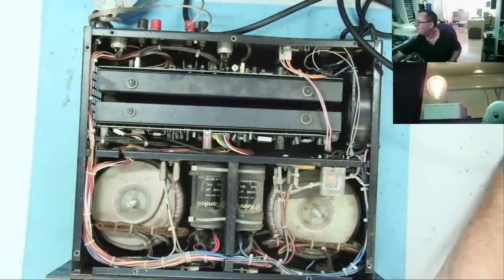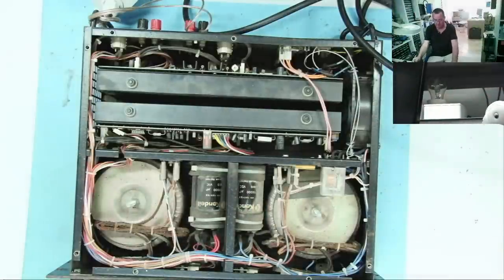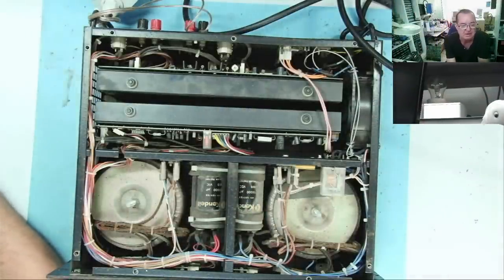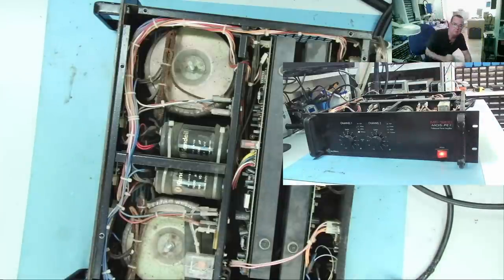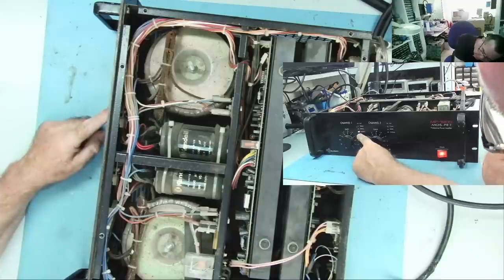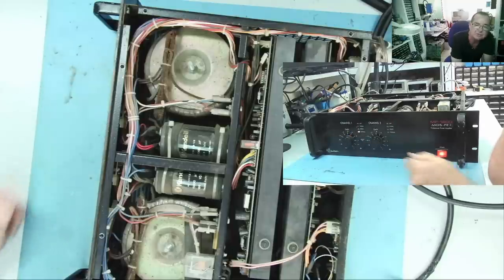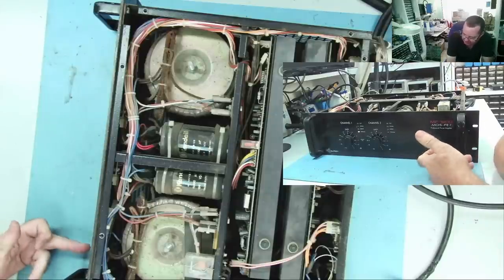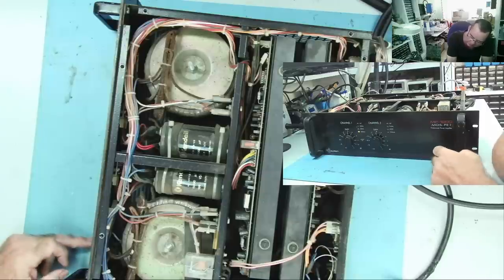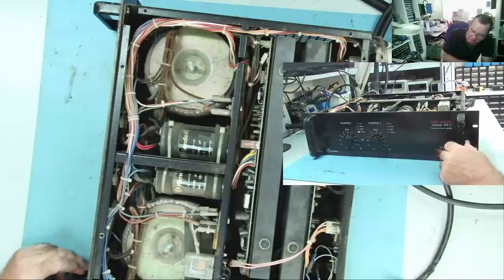It comes on bright and then is going dimmer, so that's charging the capacitors — okay, this is not going to do anything nasty. We can switch that off and we'll try and power this up. There it is — straight away this is actually saying thermal. It's not an error, it's on thermal on one channel. So that's what it's actually doing. It stays running the fans even when you switch on or off at the front. Yeah, thermal — one thermal error.